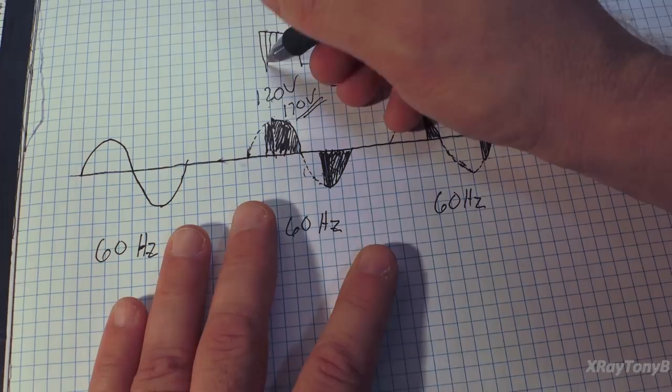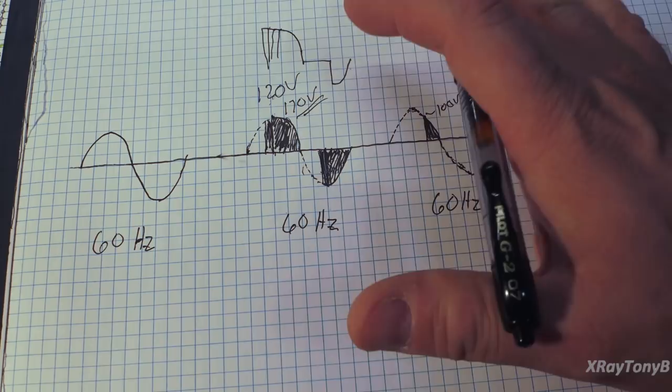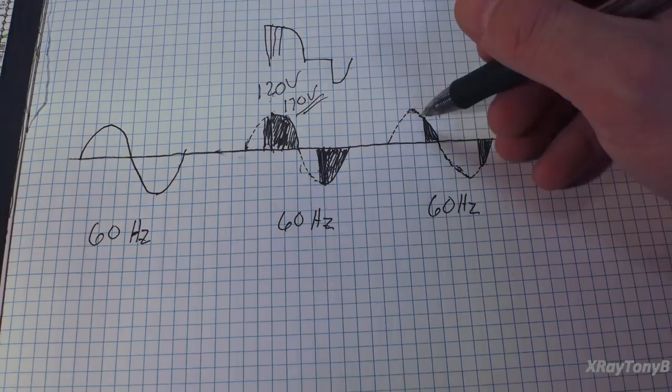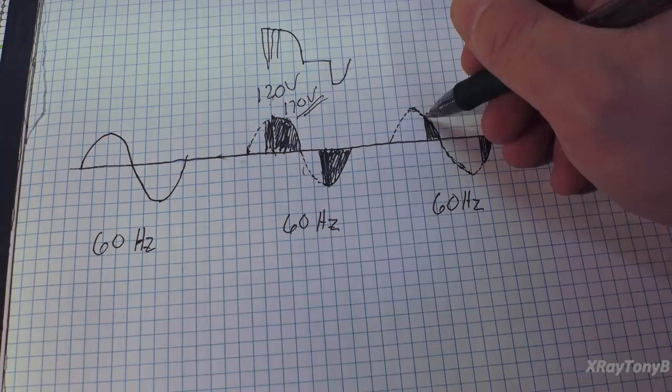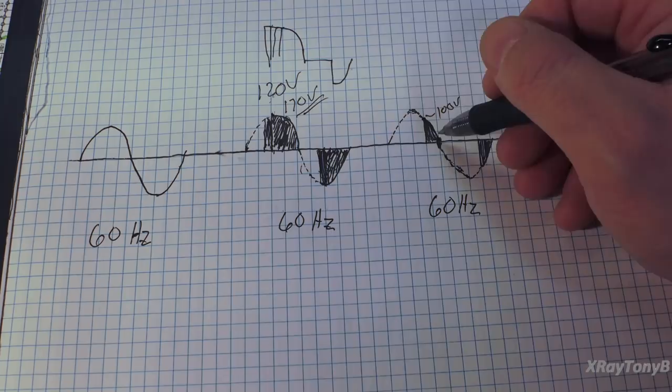I just wanted to clear that up for all of you. And as we said earlier in the second video, this is a self-extinguishing circuit. It can't turn itself off - you can turn the TRIAC on, but you have to go along for the ride and ride it all the way down to zero before it can turn off. So all we're doing is controlling when we turn the TRIAC and circuit on, and letting it finish its cycle by itself.